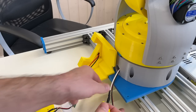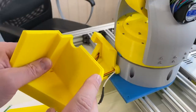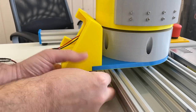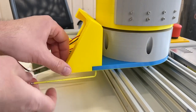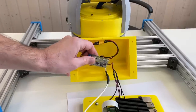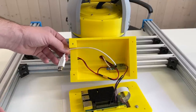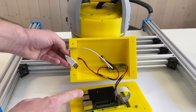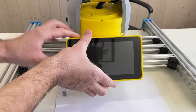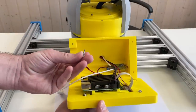These two small pieces are just to cover the cables. On this piece there is a part which goes inside this groove. The connector from the robot arm goes here, and somewhere here inside with double-sided tape we're going to fix this power converter. The USB cable goes outside from here and afterwards it's going to be connected to the USB. This is the screen — we need to fix it to this part through these holes with M3 12mm long screws.